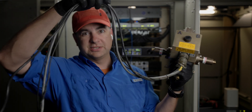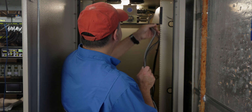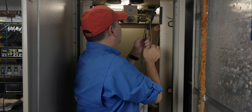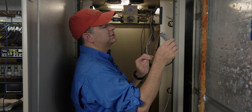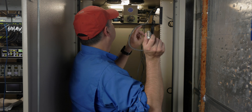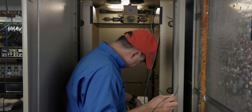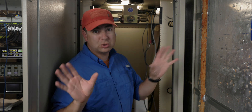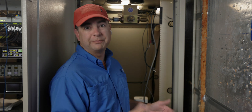I have all the control cables here. I have power, because this thing runs on power. I have status, which runs to the status panel in the next rack over. And then I have interlock — these are going to go into my remote control system, which will then go to my transmitters. You don't want to be transmitting RF while you switch — you can't switch your coax under power. Your transmitter has to turn off for however long it takes for the switch to turn, and then you can bring it back up.